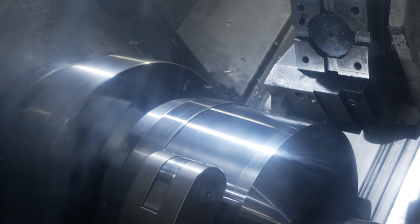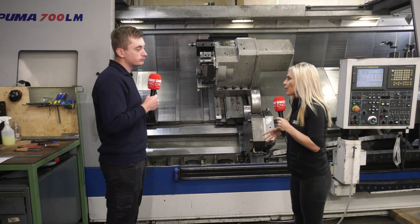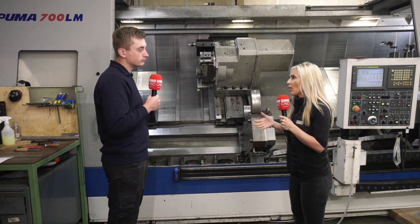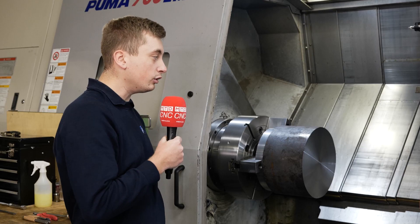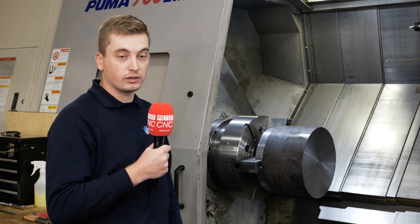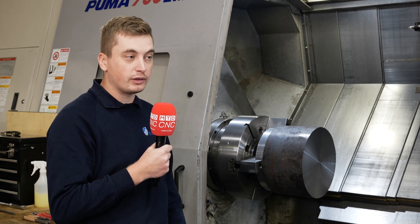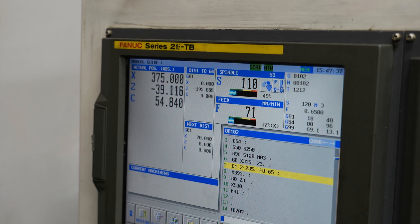So basically the power chuck has opened up new markets, but also for your staff — are they spending less time at the machine because the spindle's running more? Yes, they can get a set of soft jaws in there cutting and get on with something else, then come back an hour later with a nice set of soft jaws and chuck the billet straight in, knowing it's going to be spinning true.